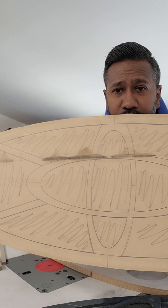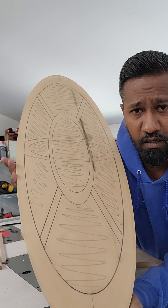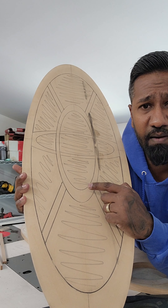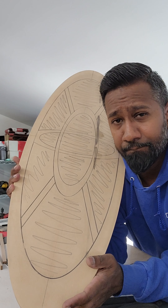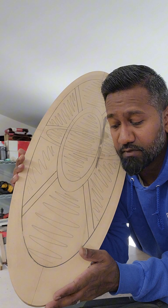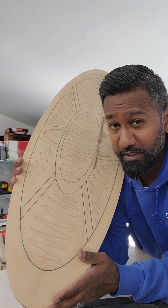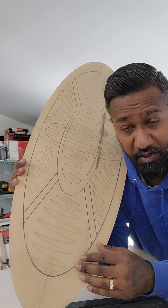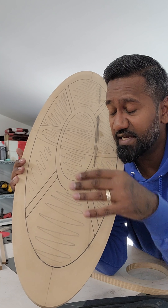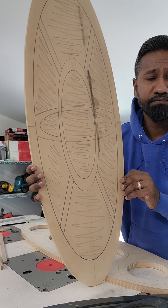Everywhere that's got a scribble is going to be cut out. Some people may ask — isn't that corner going to be really tight to wrap? That's a good question. It would have been if you were cutting this with a jigsaw, because then you'd have a really tight angle. But you're not — you're cutting this with a round router bit, so it's going to have a little contour to it, just enough to get your hands in and do what you've got to do with your final material.